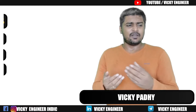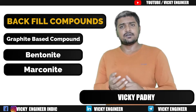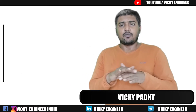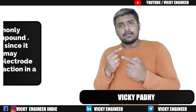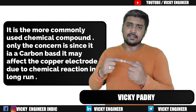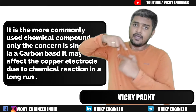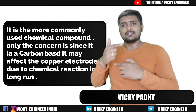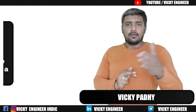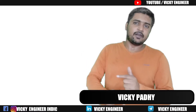There are many backfill compounds. The first, most commonly used right now, is graphite waste compacting compound. However, since graphite is basically a coal waste compound, it may affect the copper electrode in the ground or Earth Pit in the long run. That's why in some cases people don't go for graphite waste compound. At least if you are going for a chemical Earth Pit, go for Bentonite.